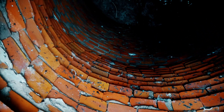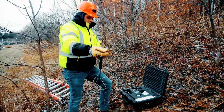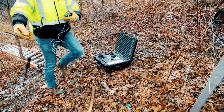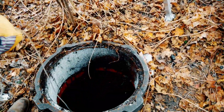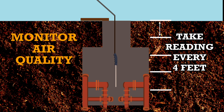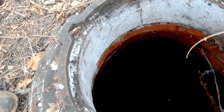It's a sewer line with water running south to north. So right before our worker comes into place to do his job, we are going to drop the air monitor in one last time just to double check — and all our levels are good, safe for our worker to get in.